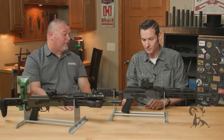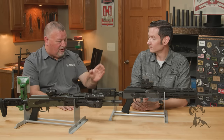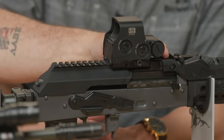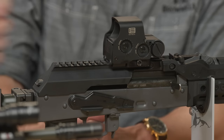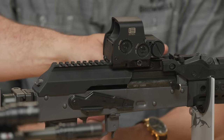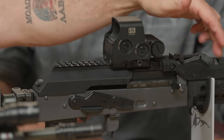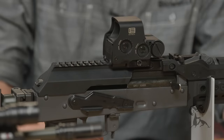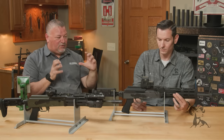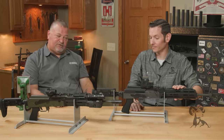And you have to control the front too. The front is a very important part to control also. This trunnion block, as we call it, is made of steel. And the outside, these little struts, we call them, are supported not only here, but they're steel struts that run on an angle down and tie into the handguard. So there are multiple points of location and rigidity that keep this thing as one solid unit. So you do have to run this dust cover with the full handguard. You can't run it solo.